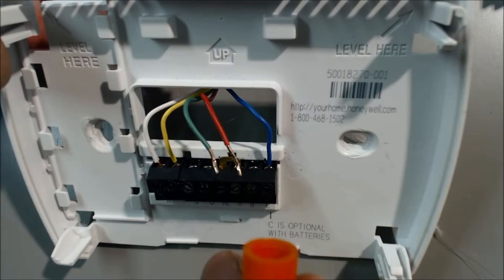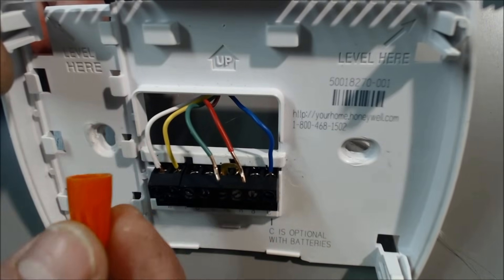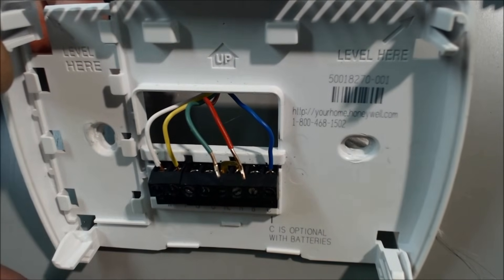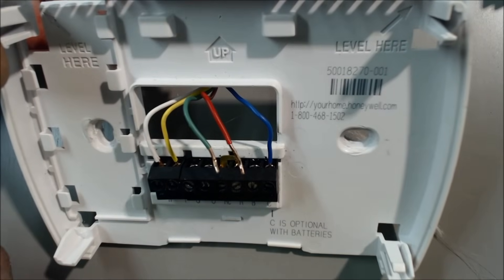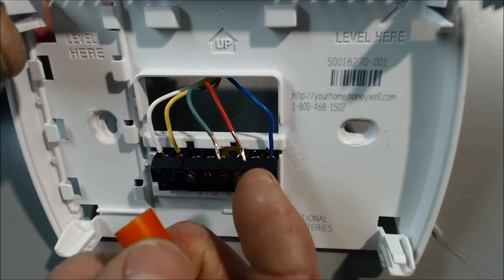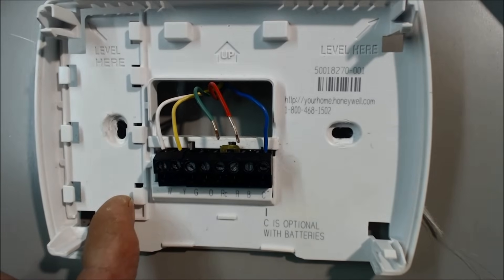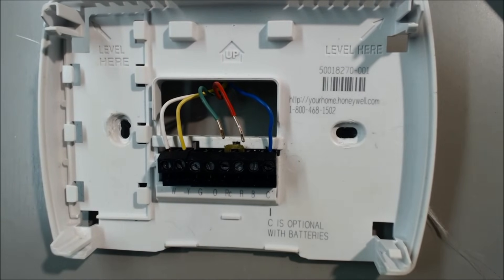That's how you do it. If you wanted to, you could turn the power back off to your furnace and wire nut the R and the white wire together to see if your heat will turn on and the sequence of operation of your heat works. I would be careful about touching this to the yellow wire because you don't want to damage the compressor — it has low pressure refrigerant on one side and high pressure on the other, and it needs a chance to equalize. The simplest thing is to just connect the red and the G together. If the fan does come on, you just need to replace the thermostat. Make sure your power is off while doing it. Hope you had a good time and see you next time at acservicetech.com.